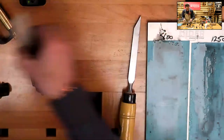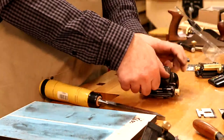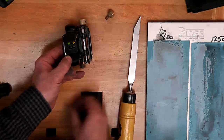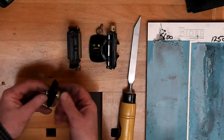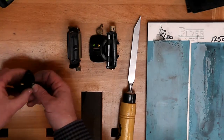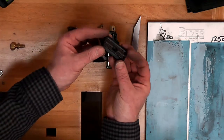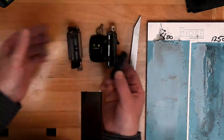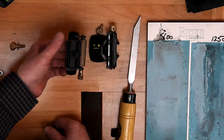Getting cluttered now, look. Cleared area. There it is. Going to undo the top knob, okay, take that off. That's the chisel head. We're going to want it back in a minute. So if you've got lots of mortise chisels or something thicker that's affecting it, they do an adapter, like this plate. All right, it will only fit on one way because it has a recess that locates on there.